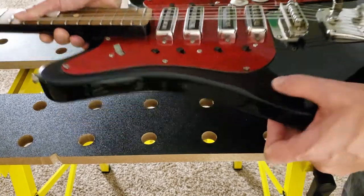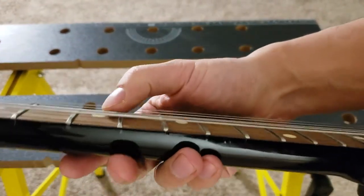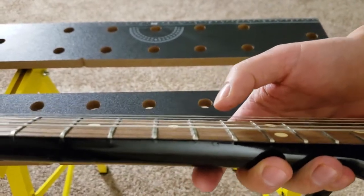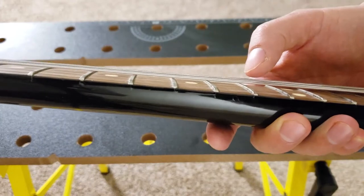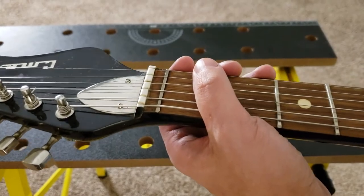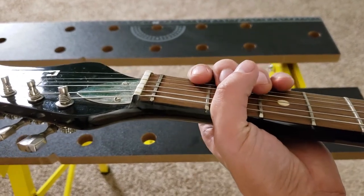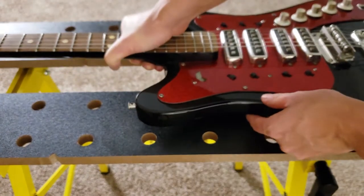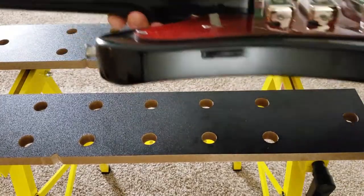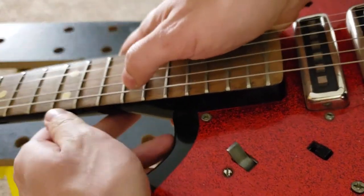The frets are so flat that I even thought that was normal for the guitar. But I don't think there is enough material left to round them. It has the 0 fret. Intonation is not good. The note on the 12th fret is higher than the open string note.